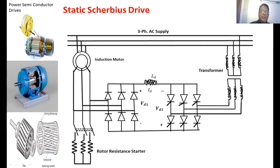Whenever a three-phase supply is given, a rotating field is created. Whenever the rotating field is created from the stator winding, there is a rate of change of flux linking with the rotor conductors. Voltage is induced in the rotor conductors and current flows through them. Each current-carrying conductor experiences a force, and collectively a torque is developed on the shaft, so the rotor rotates in the same direction. To limit the starting current, a rotor resistance is used. At the time of starting, the TPST switch is kept connected to the external resistance, so the starting current is decreased.